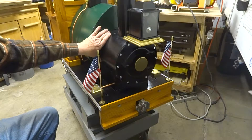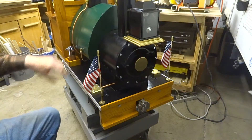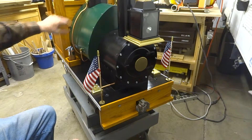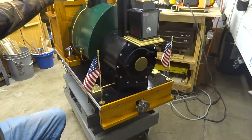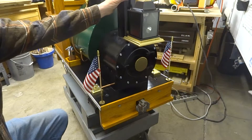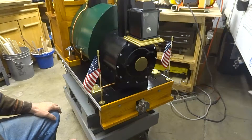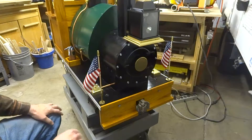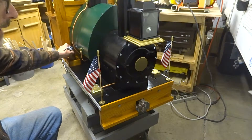Behind the smoke box would be where the main boiler is running through, and this is a water tank. These little engines were used in industry or mining and they didn't carry a tender behind them, so it was common to store extra water for the boiler right on top here. This is the sand dome — the tube here would allow the sand to run down and get between the wheels and the rails. This is the smokestack. There's a little water feed from the tank, and here's a little tray that I made for the oil can — a reminder to lubricate this moving mechanism, which is something new for me.